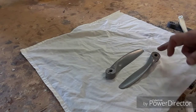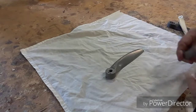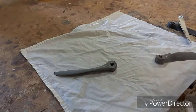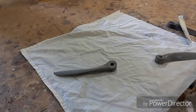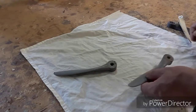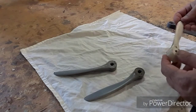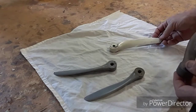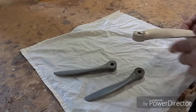The first thought was I could just buy a 14 inch propeller, cut one blade off and use that — effectively the propeller would start there and there. As I learnt over the long time of developing it, with the propeller starting out here it just doesn't work. The other problem was these propellers were way too heavy for the spring mechanism, so I eventually took a mould off them and made a hollow moulded one which was quite a bit lighter. But that propeller still didn't work due to the root chord not being correct at the correct distance out from the centre.